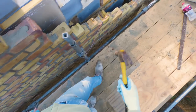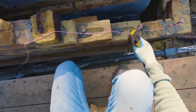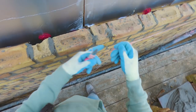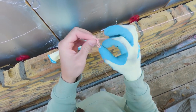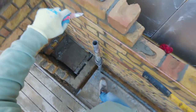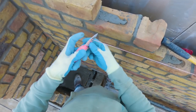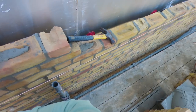First we need to set up the lines. I've already set this end up — all I've done is banged it into the brickwork because I've racked this back so I can't use a corner block. This other one we're going to bang into the wall over here with a hammer. Take your line string up to the other end, and make sure when you wrap the line around that the string is on top of the pin — makes life much easier. Make sure it's real tight.